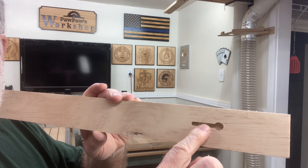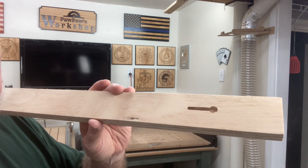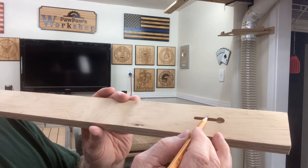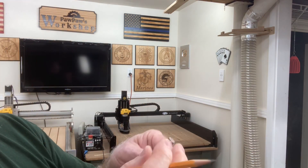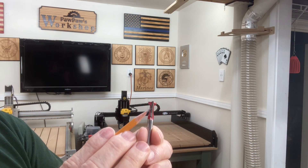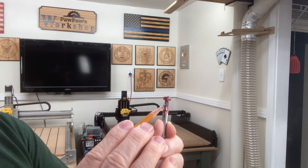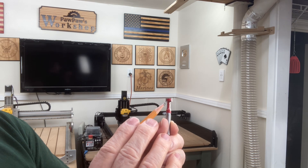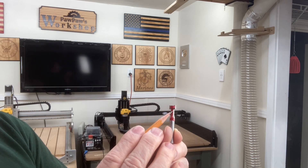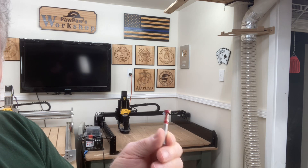You want to have this shoulder right here thick enough to support the picture from falling — it doesn't need to be real thick. In today's video, when I actually cut it, the depth of cut I made was actually 0.29 of an inch, and that's okay. All that does is give the shoulder a little bit thicker, which doesn't hurt anything. So it doesn't have to be exact, but you do have to be able to create that shoulder.